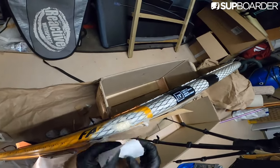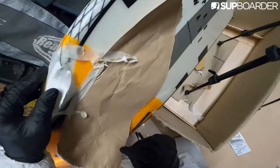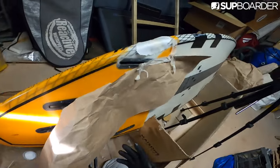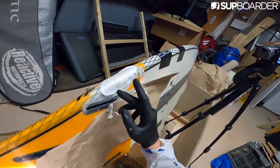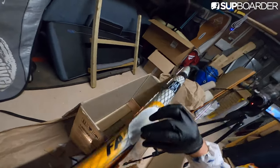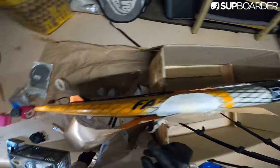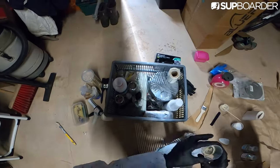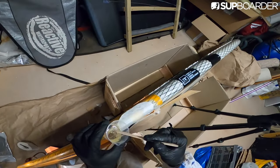So, how's that going to fit? Again, what makes this strong is the fact that the resin and the glass are working together, so you need to make sure that there's plenty of resin in that glass. Because I've put some resin down already, and this is very thin, fine cloth, I'm not wetting out the surface first. You can see that the glass is slowly getting wet out just by what I've put on there already. So I'm going to use this stick, one of these tongue things that you get poked with by a doctor. I find them quite good.